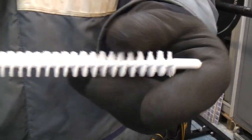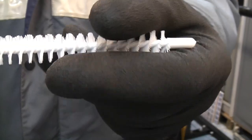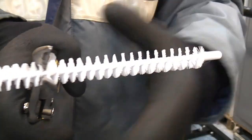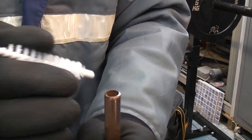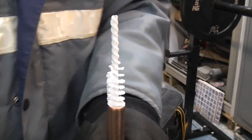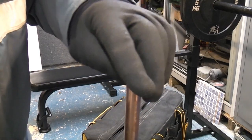We don't need the full length of the brush, so we're just going to snip the end off using some aviation snips, and then burn a bit of the nylon away. We don't want to make it too long — if you try pushing the full length of the brush down the pipe it is very difficult to pull back out. So we just need a couple of inches of this.